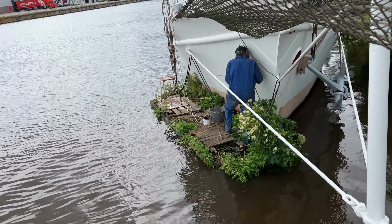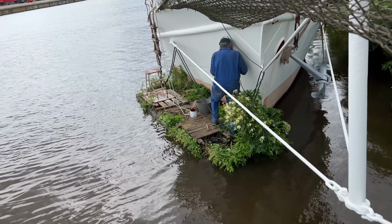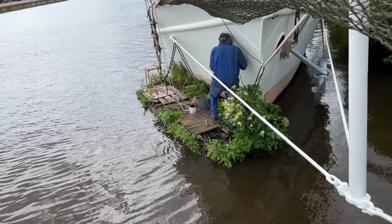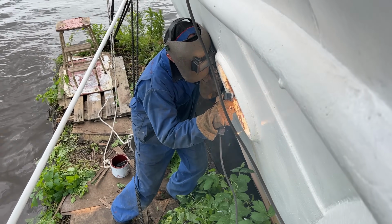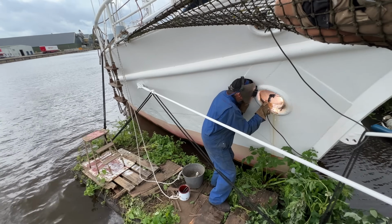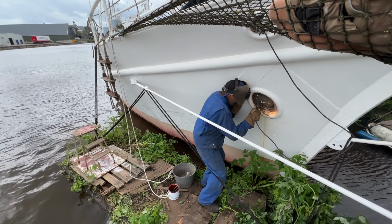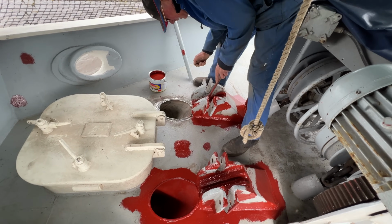So, how do we make sure that the rest of the ship doesn't corrode away around the new stainless steel hawse pipes? As said before, the current only starts running when the metals are in contact with an electrolyte. So if we can protect the steel and the welds from coming into contact with seawater, we are in the clear. A good coating will do the trick.